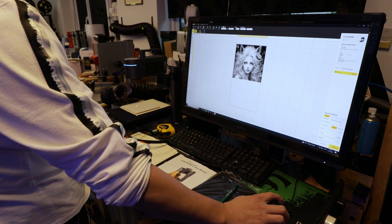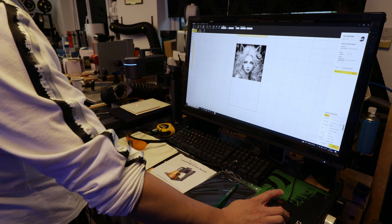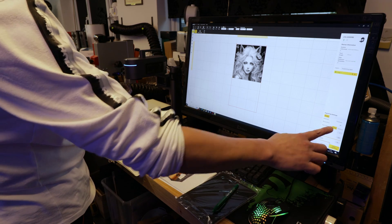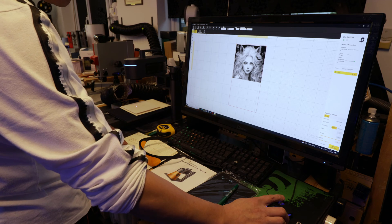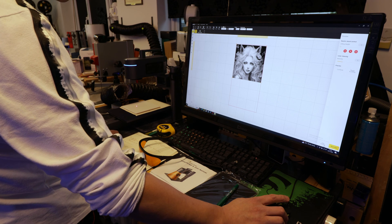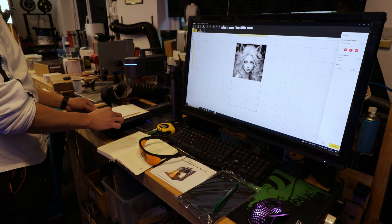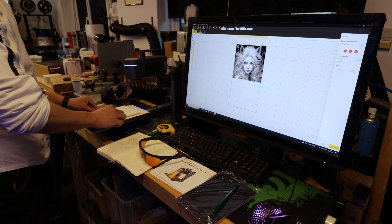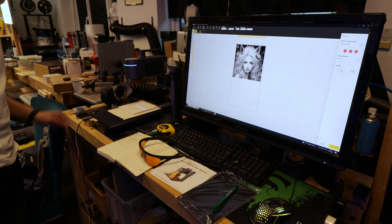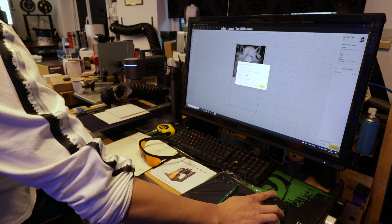I press OK and it goes back to the main screen. Now for the settings — the preset is none so it doesn't matter what you choose because you need to change it anyway. I go with titanium or metal, change it to 450 nanometer, 1K resolution, 60 power, depth is 100. Then go preview. You have to line up your tiles with the laser using the blue laser guide. Make sure the whole tile is covered, then confirm: start extender mode, power 60, depth 100.